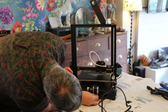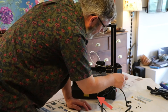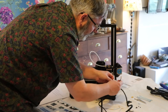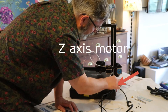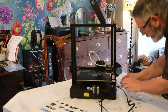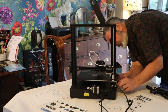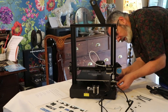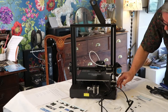Over on this side you've got 'Z M' — the Z-axis motor, which is your up-and-down movement. This motor drives the screw thread and lifts the gantry up and down — that's its function. That slots in now. The gantry end-stop is around in an awkward spot on the other side; I had to go looking for it — it's in a particularly awkward position to get into, so be persistent and work carefully. It's just a slightly awkward position, that one.